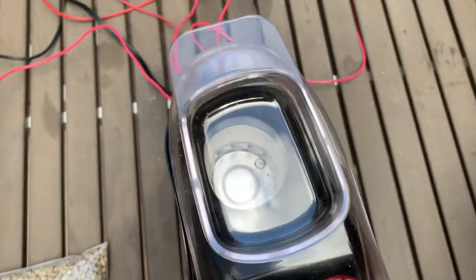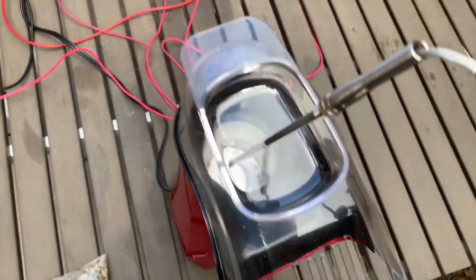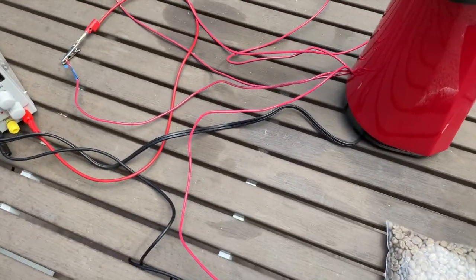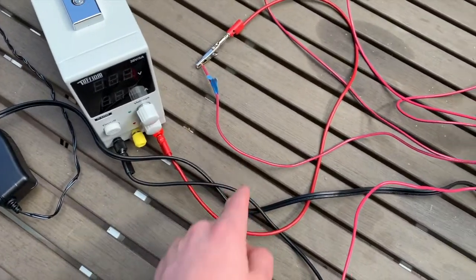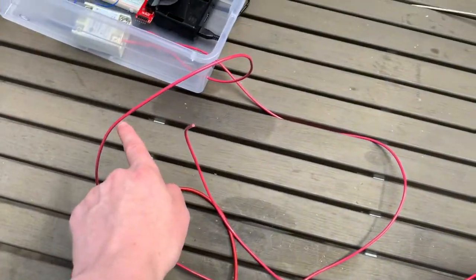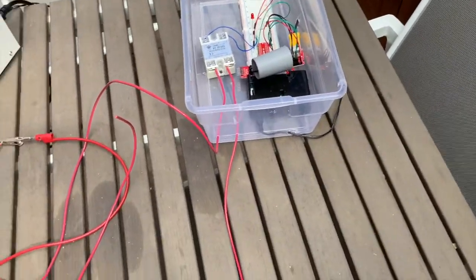We add in a thermocouple, like that. Coming out the back of the popper, we have several cables. This cable here and this cable here are used to control the fan speed, whereas this cable here and this cable here go to a solid state relay, which I will talk about in a minute.